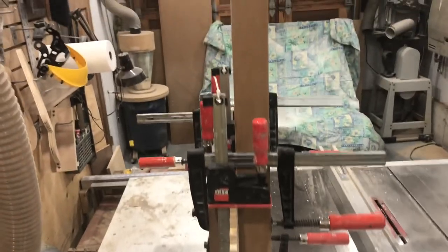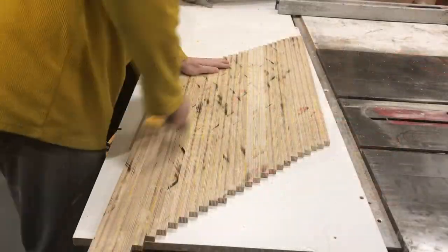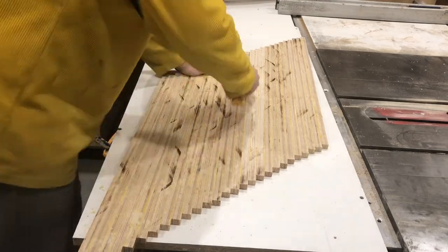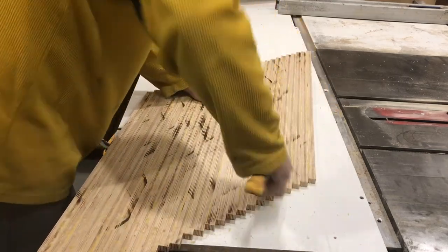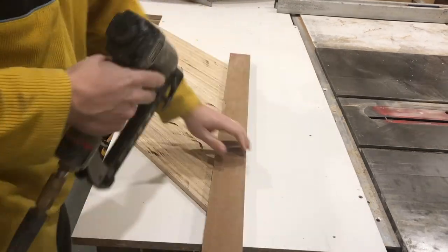The panel is all glued up now. Those strips you can see with the F-clamps are put there to keep the panel nice and flat as it dries. This job always sucks, but I would recommend scraping the panel once it's dry — get rid of any high spots, just to make the panel easier to handle as you move forward. It's recommended for sure.